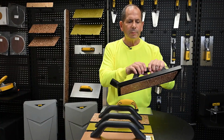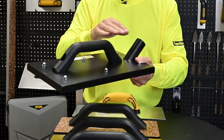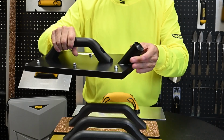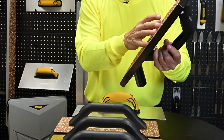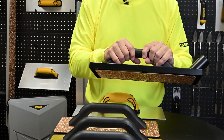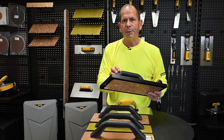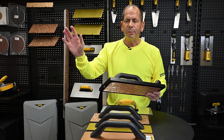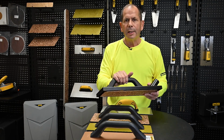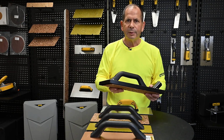Finally, there's a vacuum rasp. Comes in 6-inch by 14-inch. You see that it has a metal shroud, and this attaches to any shop vac and effectively pulls all the foam dust in through and into your vacuum and keeps that job site clean. We know that the codes are getting stricter and stricter about dust, particularly foam pellets being spread throughout the air. So whether it's this or our dual disc sander and our backpack vacuum, we've got the answers for you as far as dust-free EIFS rasping.